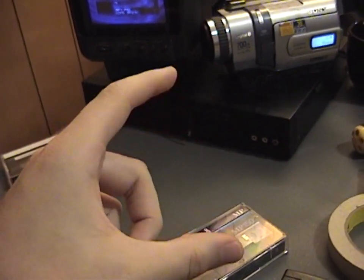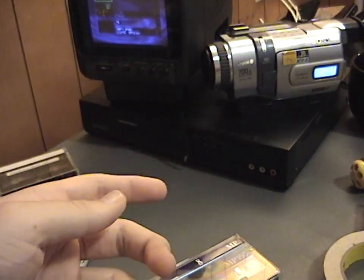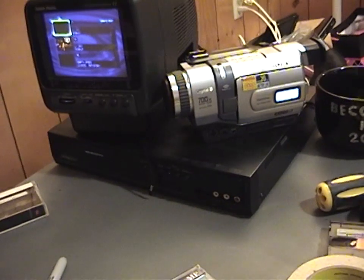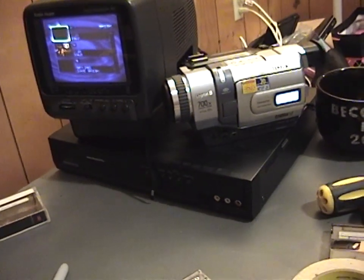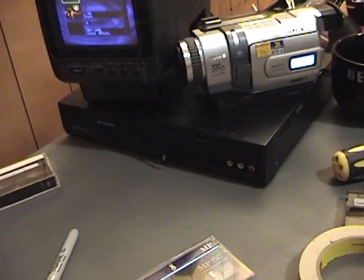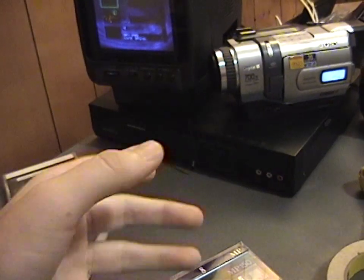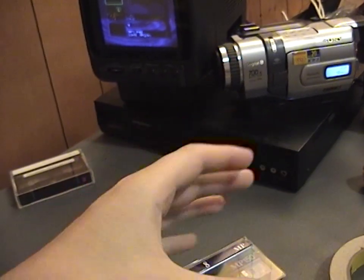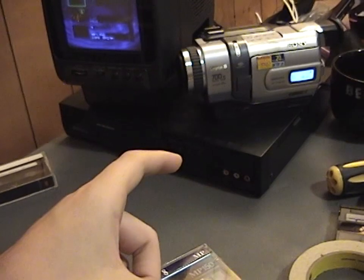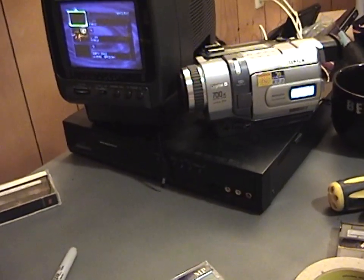There's going to be places where the clock cycles are more stretched out or more compressed than they should be. This is basically why you get an unstable signal when you play back the tape — the time-base is all messed up. On a machine with a built-in time-based corrector, it reads the time-base on the tape and buffers the entire video signal for a fraction of a second. When it encounters a point where the time-base has an incorrect speed, it uses that speed to appropriately slow down or speed up video playback so that portion of the video has the time-base running at the correct speed, producing a better quality playback on a tape with a damaged signal.